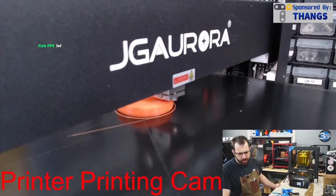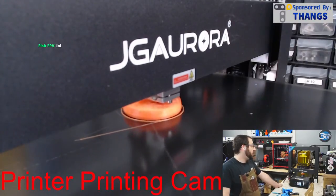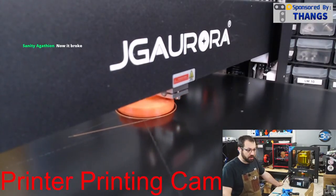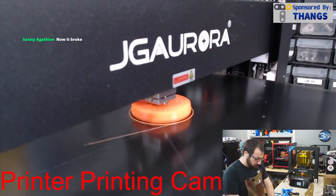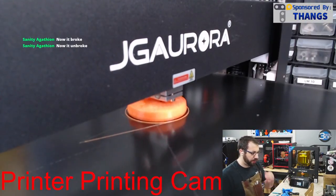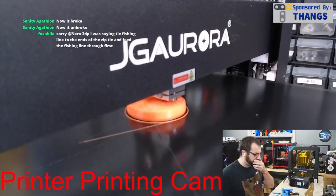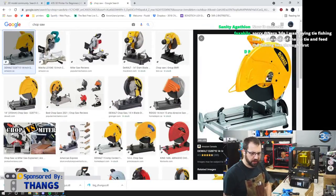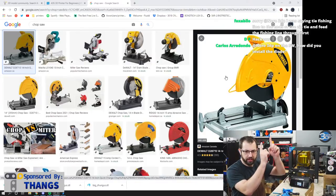Any advice for the best way to cut a lead screw? You need a chop saw type thing. Look up a chop saw. An abrasive cutting wheel is what you really want. That's what I've cut mine with. You want something like this. So, abrasive cutting wheel, one of these.